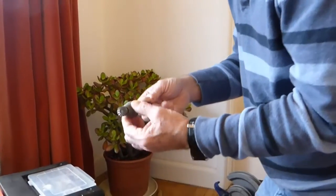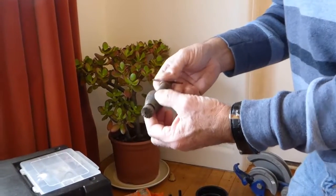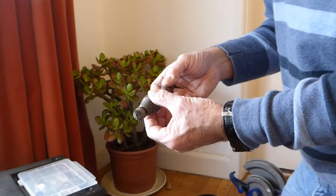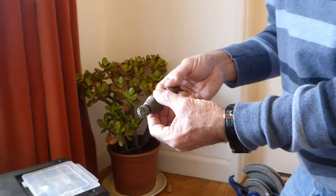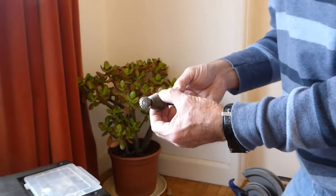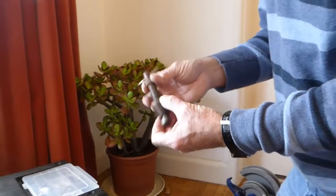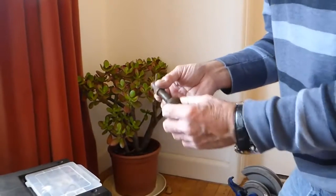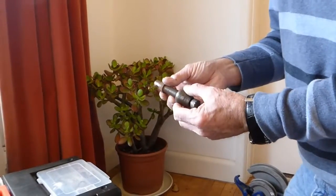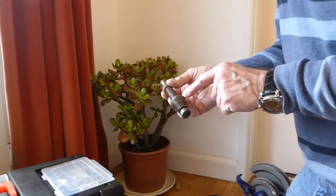Tap seating tool — if you live in a hard water area, if you're around the London area or Kent, you've got chalky hard water and the taps will need grinding out. Invariably it's not the tap washer a lot of times — there's a cut in the seat of the tap and it will need grinding flat with one of these. I live in the southwest now so I don't use this anymore because we don't get any cut seats. If you've got soft water you won't need it, but if you live in a hard water area and you're doing taps, you'll need one of these.